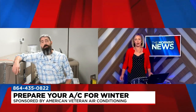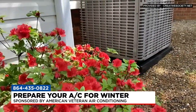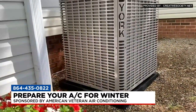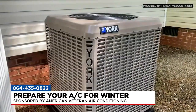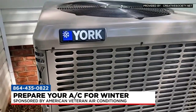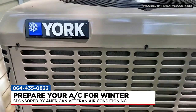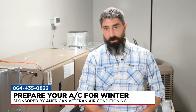The second recommendation is to clean the outdoor unit. A lot of folks don't really get this — we talk a lot about spring maintenance, but a heat pump is still utilizing the outdoor air and needs that transfer of heat across the coil. If it's been clogged up from mowing the lawn, mulch, and debris, you've got a restriction of airflow. Make sure that coil is cleared off: pull power for the unit first, then give it a good rinse, even through the coils. It's not a true professional cleaning, but it takes care of a lot of debris. Also get the drain holes cleared out underneath it.